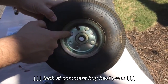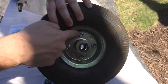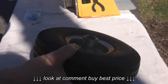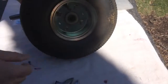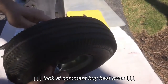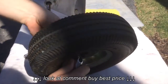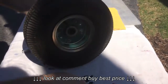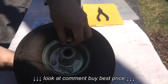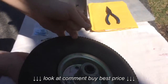The next step is to remove these bolts one at a time to put the replacement washer in from the recall kit. This can be a little tricky, so I have a wrench with an extender — about 13 millimeter. I'm using an adjustable wrench on the front just to hold it, and then you take it off and it comes right out. There is a lock washer there as well — you don't want to lose that.